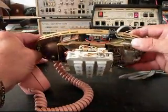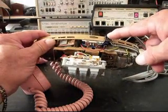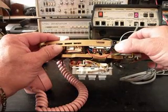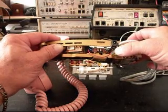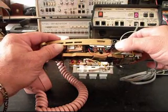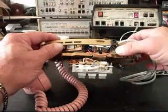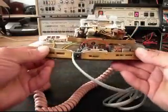The other issue was we installed for Susan a plug, an electrical plug like you would have on any kind of a telephone or answering machine. The reason why we did that is because in the old days they used to run the transformer to the jack and come up the second pair of the line cord and feed power to the light. And we don't want to do that any longer because we don't expect the customer to get into the telephone jack and wire a transformer into that. So we make it more plug and play. And we'll give you a look at that.